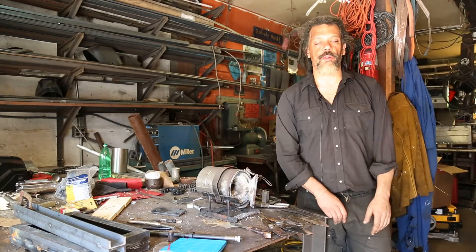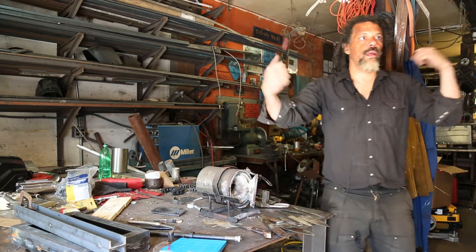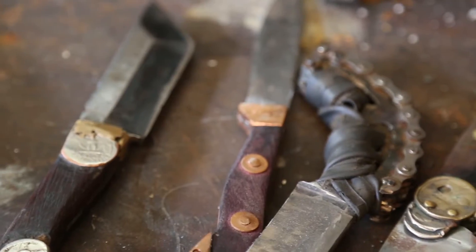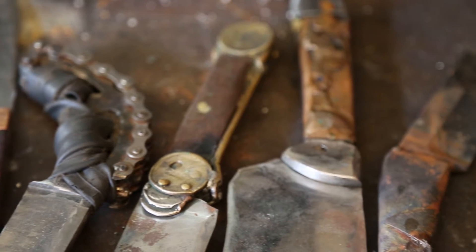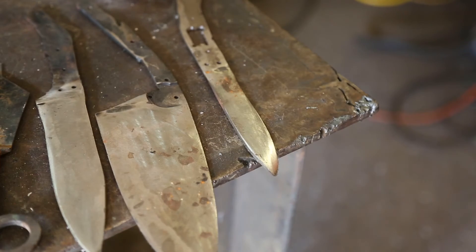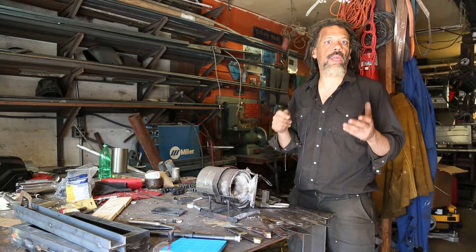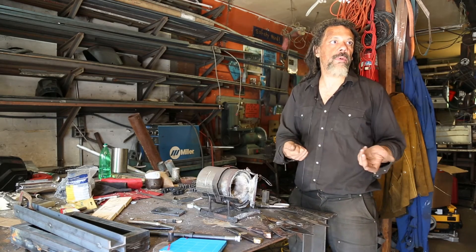For materials, I was making crossbows a while ago and it was driving me crazy — keeping the metal springy, et cetera. These knives are made out of the same steel that is in the leaf spring of a car or truck. It's 5160 carbon steel. You cut the steel out, grind and shape it down, then heat treat it, and then do all the different tempering to get the edge so that it's hard enough to keep an edge but also flexible enough that it won't snap when you use it.